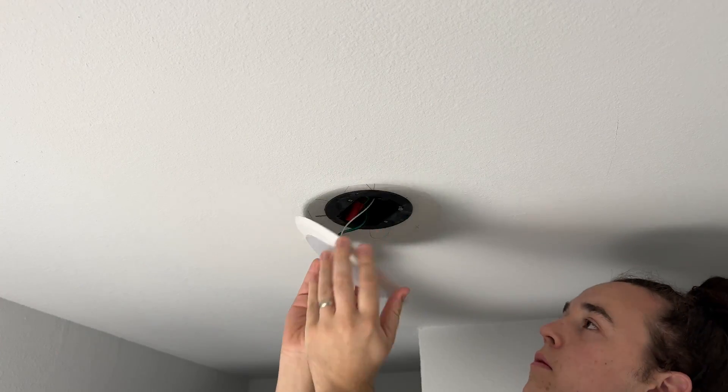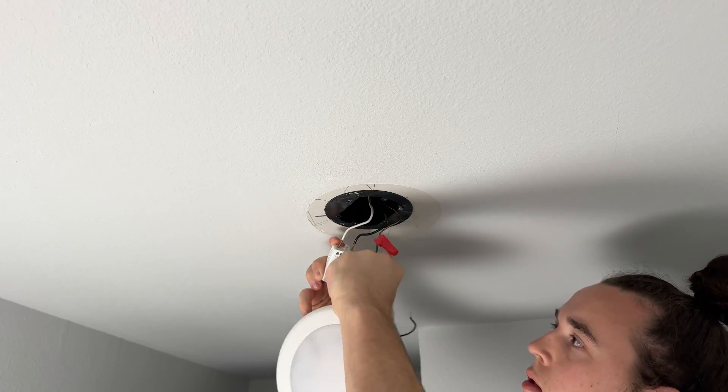Ever has very detailed instructions and I'll link the video and user manual in the description below. After installation they fit right inside the junction box. The relay setup consists of two separate devices: a smart relay installed at your light fixture, and a smart switch — the smaller one — that goes with your actual light switch. The smart switch is optional; if you install just the relay at the light fixture and your switch is turned on, you can control the fixture via Wi-Fi. However, I definitely recommend installing the smart switch too, because that ensures control regardless of the switch position and even during a Wi-Fi outage.